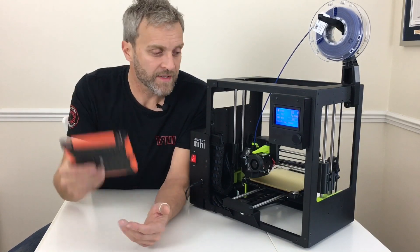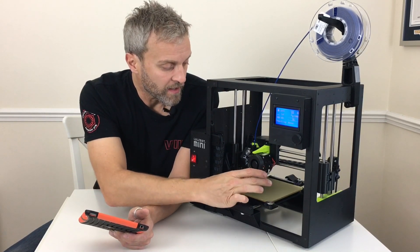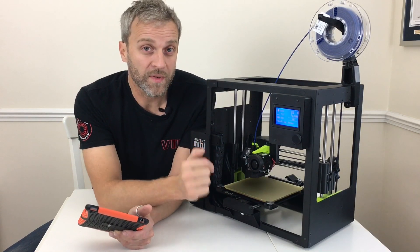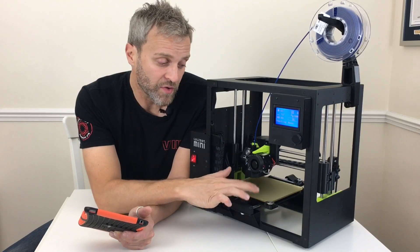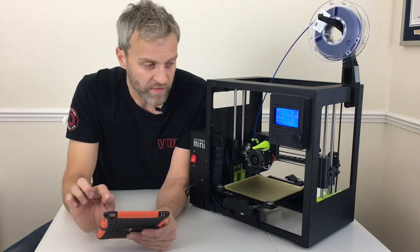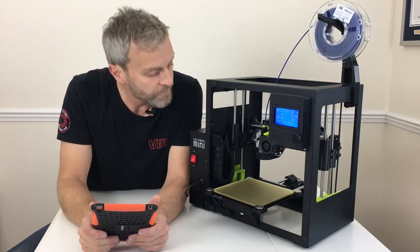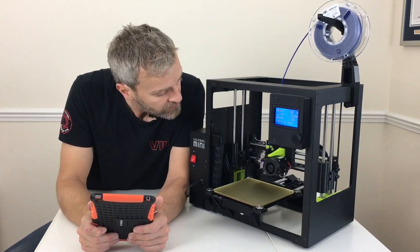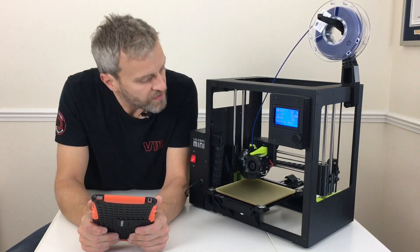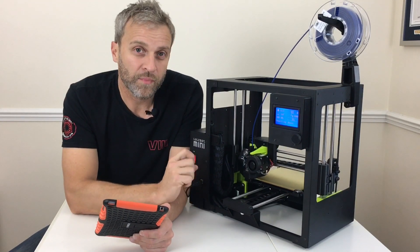I've connected my Mini 2 to my OctoPrint server so I can access it from my iPad. I've looked across the bed and figured out I can make the two-by-eight plate — the largest plate on the go-kart kit — at two-and-a-half times scale. That's half the scale I've been doing on my TAZ 6. I could go a little bigger, up to about 2.8 or 2.9, but I didn't want to push it and 2.5 seems like a rounder number. We're doing the homing sequence down to clean the nozzle — the actual movement is much quieter — and now doing the Z leveling with a good touchdown on the first pad.